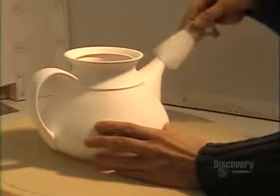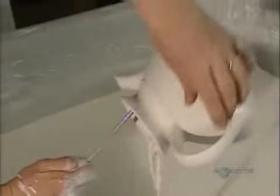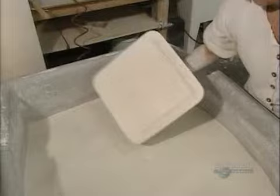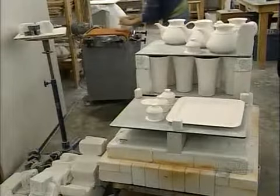After brushing off any dust, the craftsman dunks each piece in enamel, a protective coating. The porcelain absorbs it right away, and this glaze turns into a shiny skin once the pieces are fired again. She handles each piece in a particular way to avoid leaving drip marks. In the second firing, they make the porcelain pure white by carefully controlling the air in the kiln.